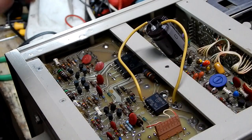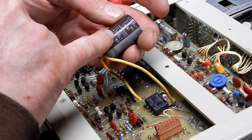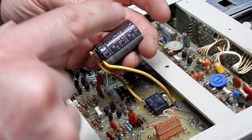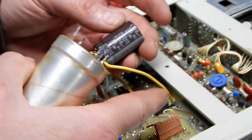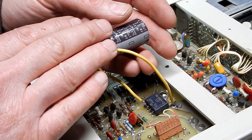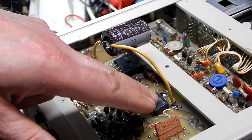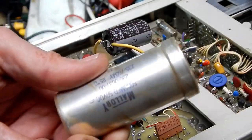I don't have any 5000 microfarad 50 volt capacitors laying around. I just pulled this out of an old TV chassis — it's a 4700 microfarad 35 volt. The 4700 being a little lower in microfarad, not so great, but that'll work. The bigger concern is this is only 35 working volts and the one I'm replacing is a 50. However, usually the caps are overrated — the actual voltage on the circuit isn't going to be the full 50 volts. I should be able to get by with this just for a short period of time for testing purposes to see whether or not this thing has a chance of coming back to life.